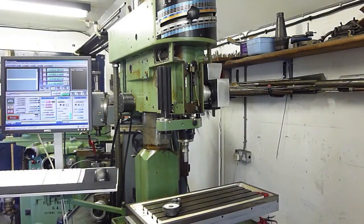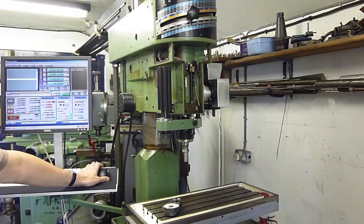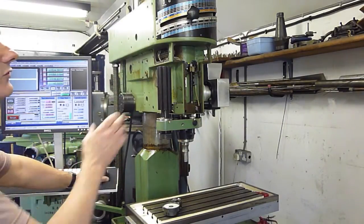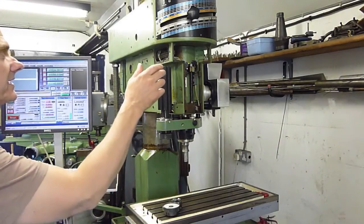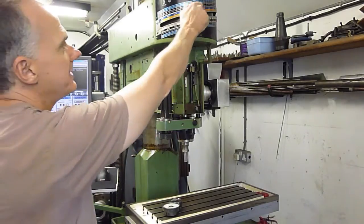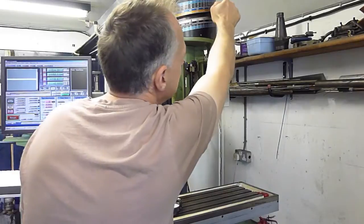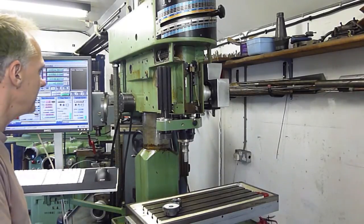I'm not really sure that I'm going to use 100rpm. On the big manual milling machine I may well get the speeds down to that low for using a big slitting saw or side and face cutter in the horizontal, but it's probably unlikely. So I might get away with this set where it is now, because I chose this speed range to get up to 4000rpm. But if I want to run it down to slower speeds, it's quite easy for me to run the speed down to half that setting again, which will give me half of whatever's indicated on the drive.